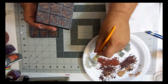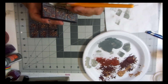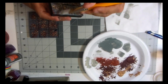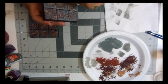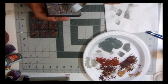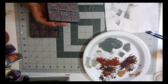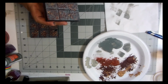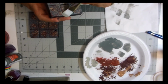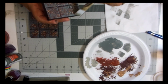Again, just a little paint at a time. Take most of it off. You're not trying to recoat the project. You just want to make everything kind of stand out. Again, these strokes, you want to have them come all the way through your project, because you don't want to have them not stand out. You don't want to have them start off, and you don't want to go back on your piece. That'll look bad. So you're just taking full long strokes all the way through.